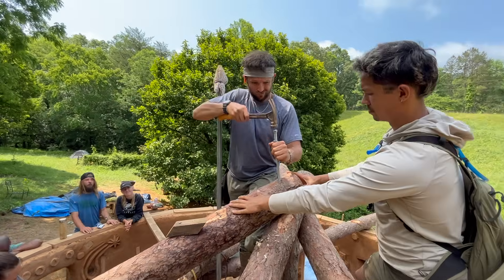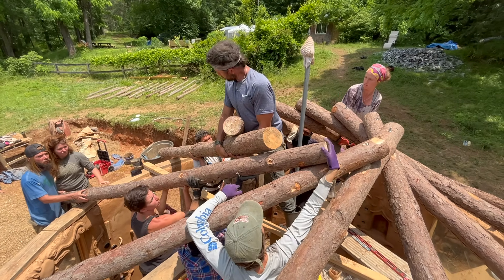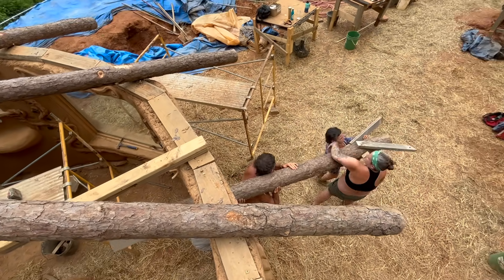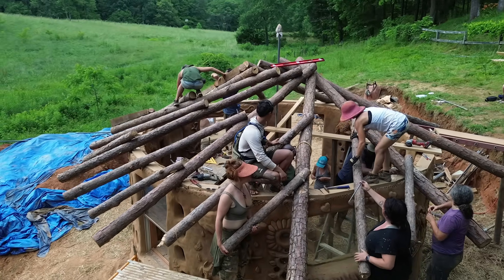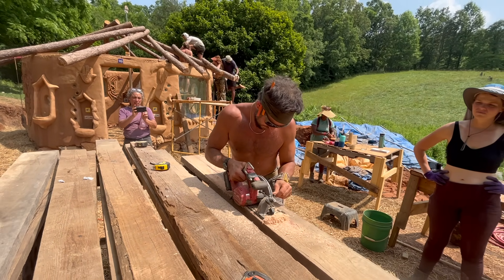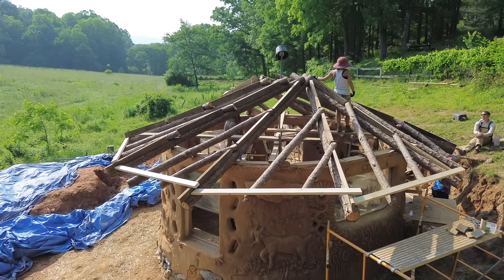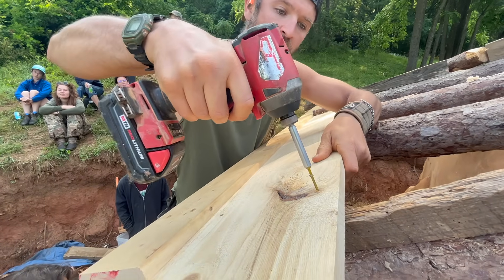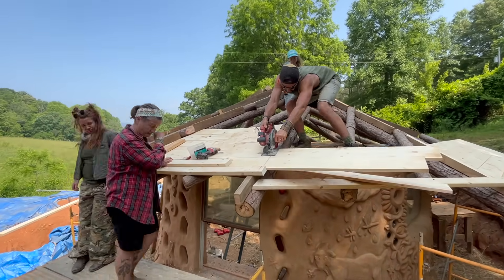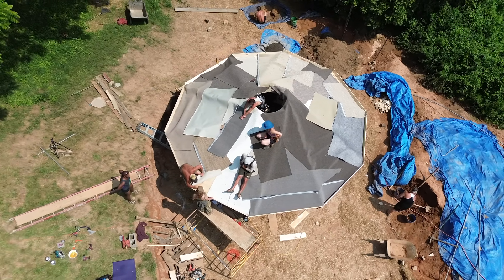We work our way around attaching the rafters with threaded rods and bolts, and once we get to the final rafter, we lift slightly on the rest of the rafters and slide the final rafter into place. Once all the primary rafters are securely installed, we remove our charlie stick. We then install the secondary rafters, which add structural support for our sheathing boards, and begin cutting and installing shims to level out the planes of the roof. Once all shim boards are installed, we attach our sheathing boards and then use a chalk line to give them all a clean cut. Once the sheathing is complete, we install our insulation layer using scrap pieces of carpet, followed by our waterproof membrane.